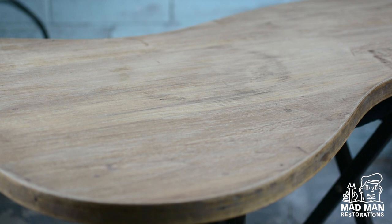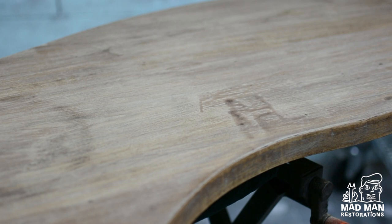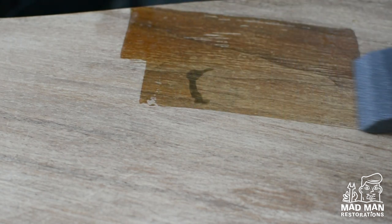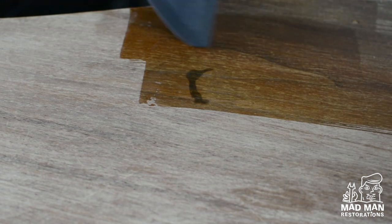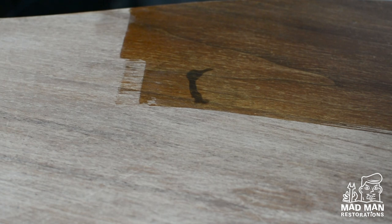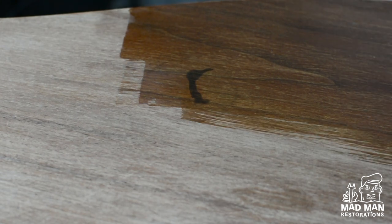This is what it looks like completely dry. Now I want to try and remove these old water rings, so I apply some oxalic acid. As you can see, after applying the oxalic acid an old stain has appeared — it looks like an old ink stain, and if that's the case, oxalic acid will have no effect on it and it will have to be something I address later.